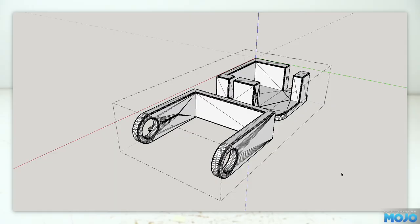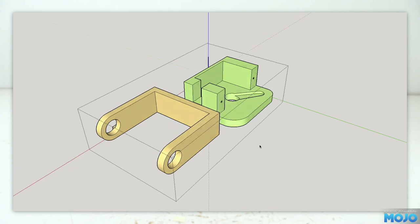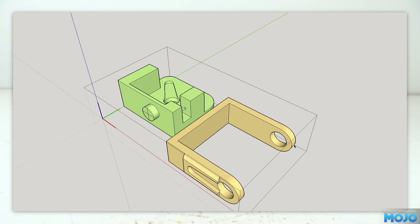First up we have the original parts imported from the STL files. They were designed by Klopex — K-L-O-P-E-X — and are available on Thingiverse. Again, link in the description. For the Tundra gimbal I tidied them up and added a slot in the bottom for the pan servo arm. It works fairly well, but those little SG90 servos don't have an output bearing as such, so it's a bit wobbly. On the plus side, it is a very lightweight system, which is good for a flying model.